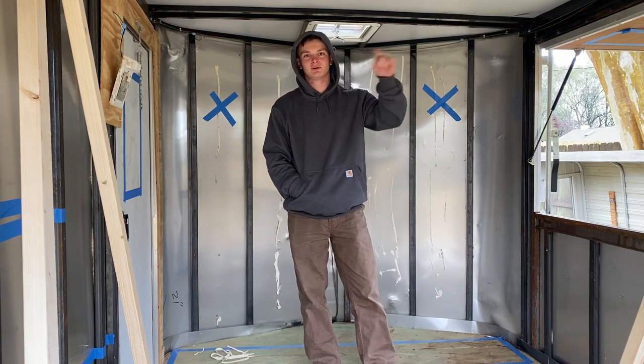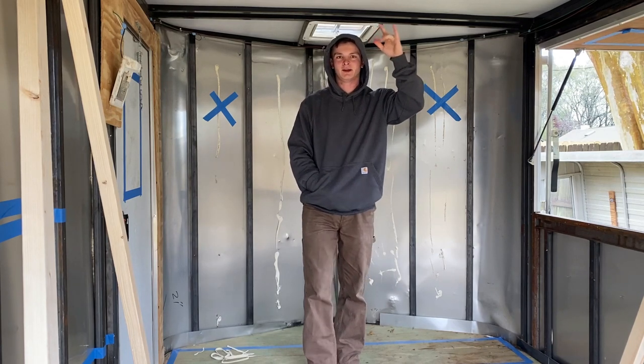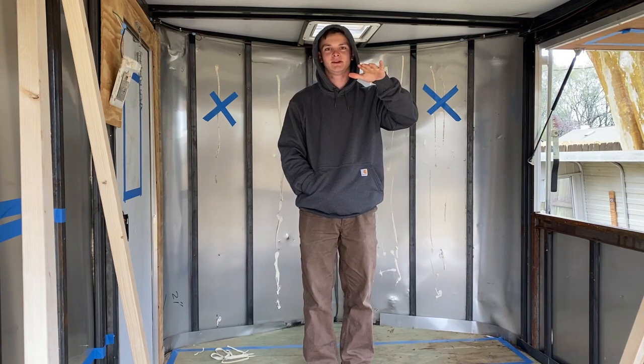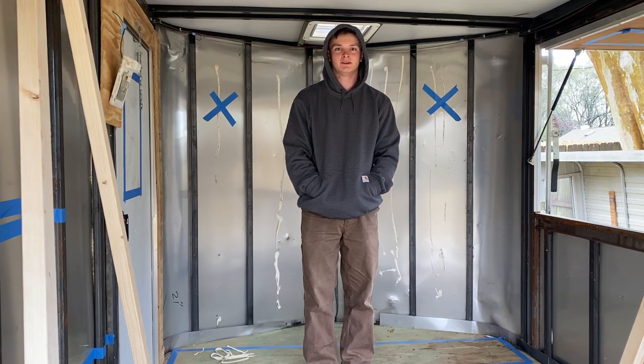From there, once both holes are cut, cutting out all the joists and also getting the top sheet metal cut out, we're gonna have everything braced up, come reset the saw horses and drop that into place, clamp it together with some bar clamps, and then weld it up.